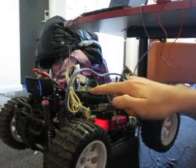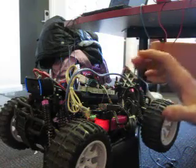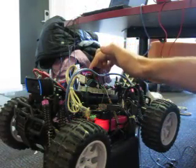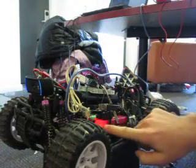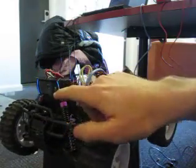As you can see, I've got the remote control battery which is actually running all the electronic components, not only the motors for the remote control car. I'm taking it off and going through a couple of linear voltage regulators, which comes down to a USB hub, and that's powering my Raspberry Pi, my Arduino, and the webcam up here at the front which is giving me live feed.